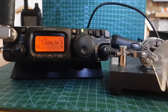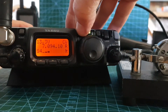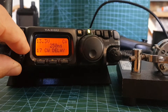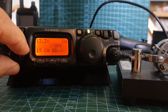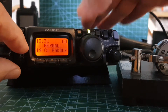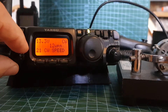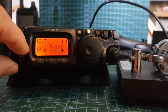Basically, if you hold down the F button here — let's just turn that down — hold down F and you've got the menu. Going to the first relevant ones: 17 is CW delay, 18 is CW ID, CW paddle you've got normal or reverse, CW pitch which you can change with the VFO, CW speed set to about 15, and CW weight at 1.3.0.